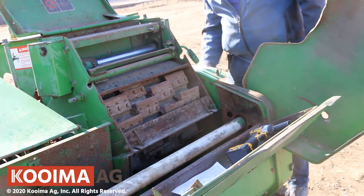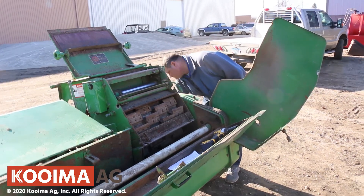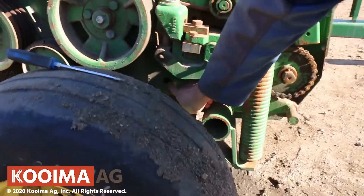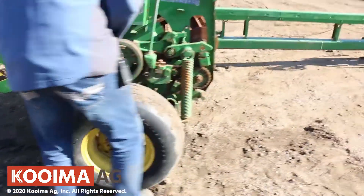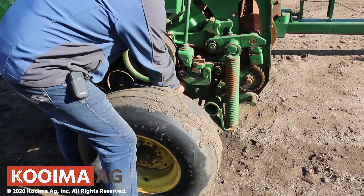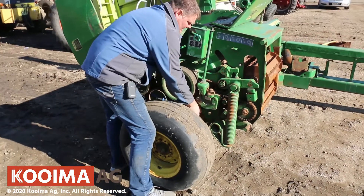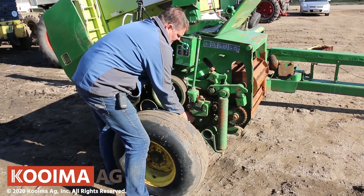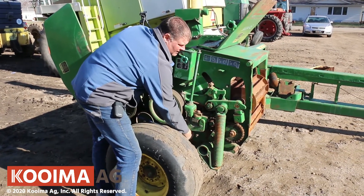The trick is there are two holes in all the frames right underneath the feed rolls — a couple of big holes. This is where your three-quarter inch bolt goes through and you can feel the cracker plate on the inside. We need to line that hole up. Get it really close first by moving the back of the cracker plate and feeling with one of your fingers in the front. Carefully hold the cracker plate in the back and then just hand-tighten them for now. I like to tighten those two bolts last.